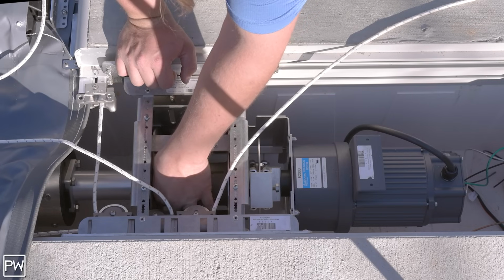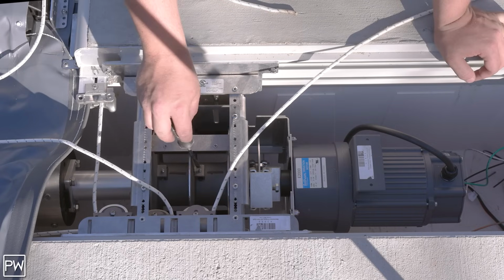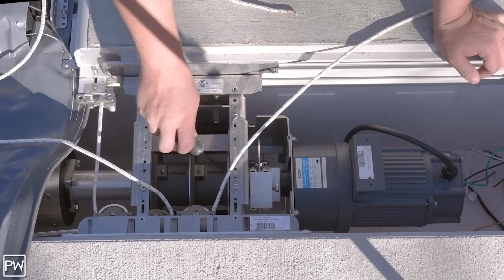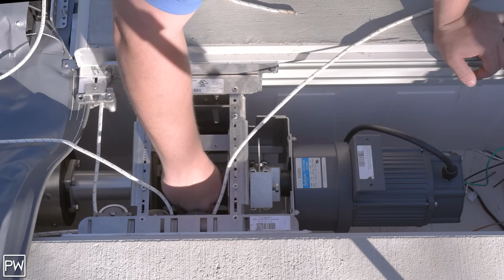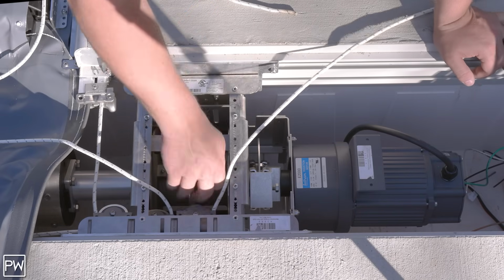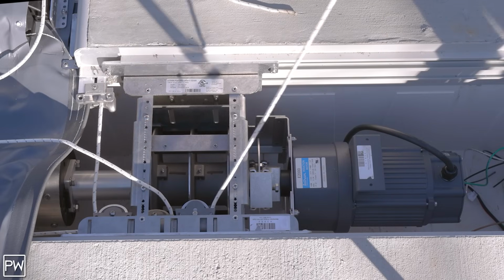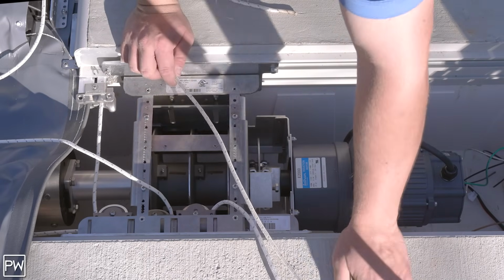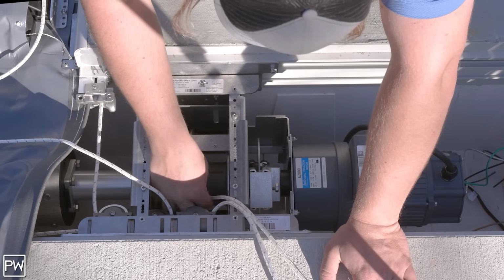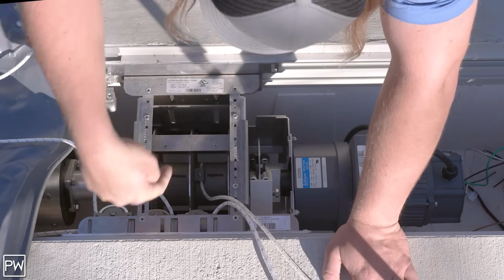We're going to just take this little black bead out. That is trash. That's just simply to keep these screws from vibrating out during shipping. So again, backing that screw up far enough to get this out, but not so far that we're gonna back the screw out and lose it. So again, this rope is gonna correspond to this side of the reel. The ropes will always go through the set screw towards the water.